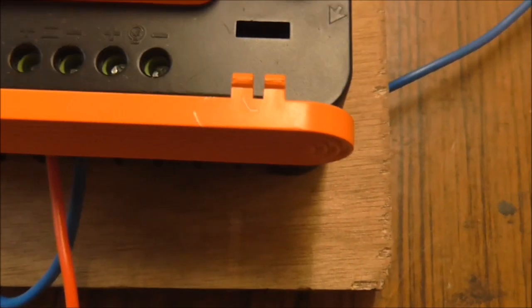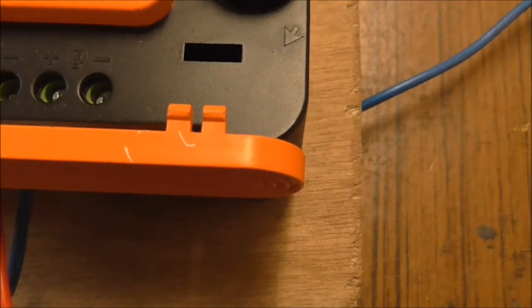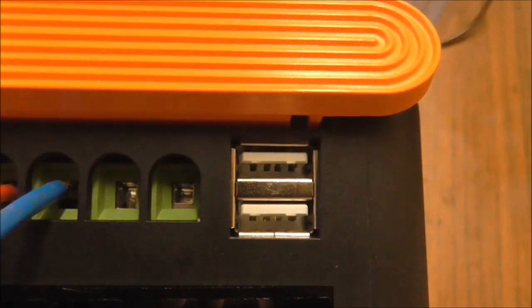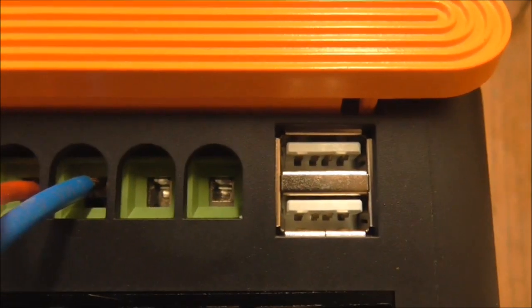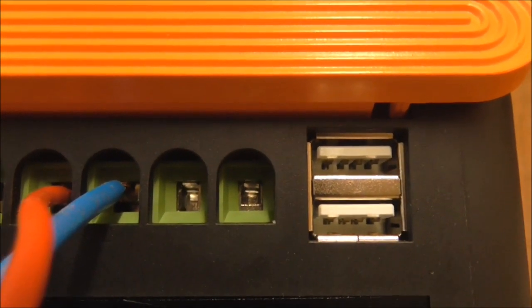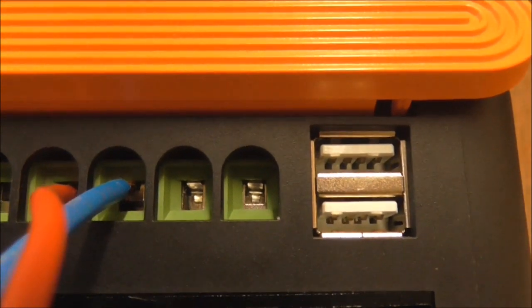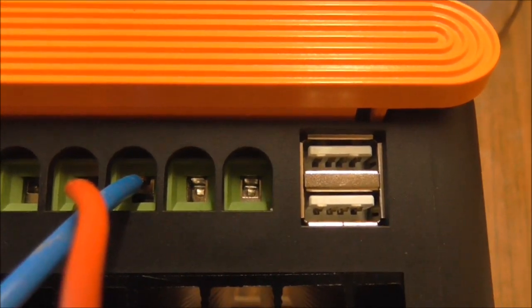You can see the commenter's remarks in the first video and I'm glad he alerted me to it. His recommendation is to put a diode across the positive and negative of the motor - a flyback diode in parallel. I might actually join it in here with the power going to the pump. It's a reverse diode - the cathode goes to the positive and the anode to the negative - so that when the pump is slowing down the back EMF coming up the negative will cross back down the positive cable to the motor and create a brief short circuit, preventing any damage to this controller.